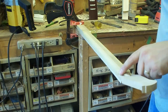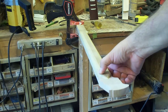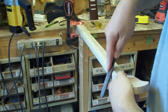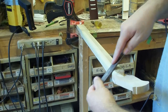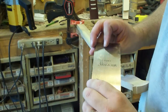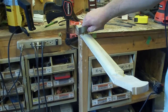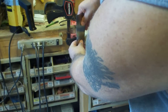You can see I couldn't get the router clear up here into this end, so what I'm going to do — and what you can do back here at the back of the neck — once you've decided exactly where your box is going to set, just take a file and work it the rest of the way down. It's pretty easy. Another tool you can use that I've gotten quite fond of lately is just a cabinet scraper. Like the router leaves a little bit of a line there — just bring that along and it'll scrape that right off, make short order of it. You don't have to spend an hour filing or sanding on it, and just work your neck down from there.